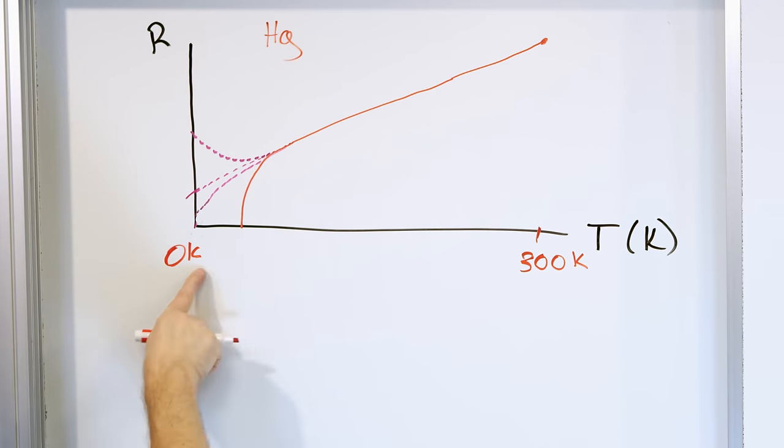I'm going to say that one more time because that is really the core of the theory. Because the thermal agitation has stopped, in some materials the electron can attract nearby positive nuclei. Remember, the electrons are more or less unbound. I mean, not totally unbound, but very, very loosely bound. So mostly you have the positive nuclei left behind, attracted, making an overall positive region. The incoming electron, the next one I send in, sees this and is sort of attracted to it.